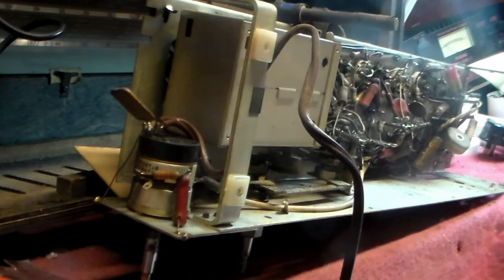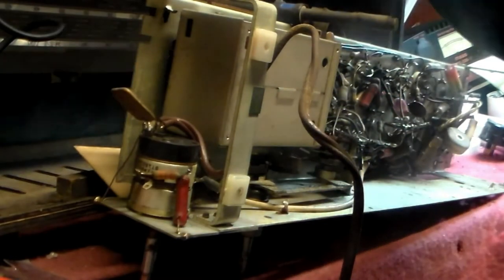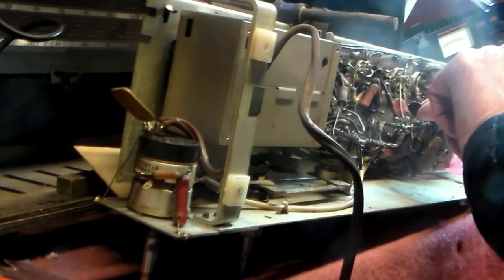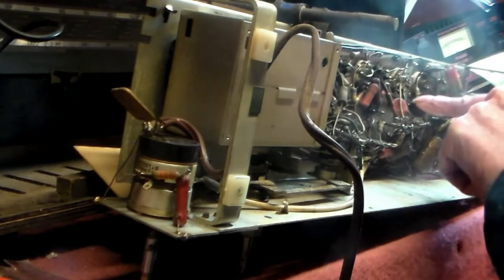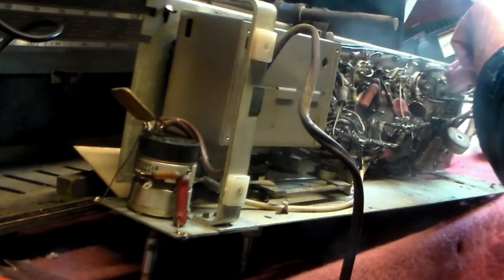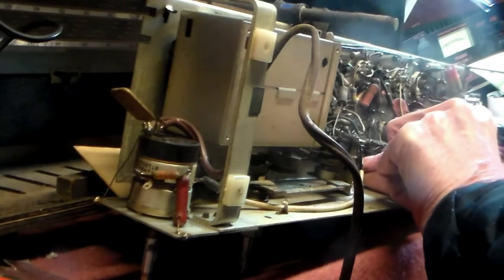And the other end of it goes, sometimes by a resistor, to the first grid of the 8-pin pentode. Don't write that for now, just look for that capacitor, which is what I've done here, okay? And it's this one here, yeah? So that one needs to be changed, yeah? That one, yes, it needs to be changed. That one, yeah.